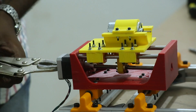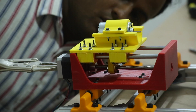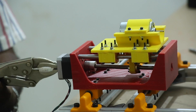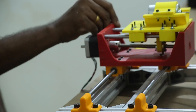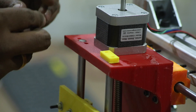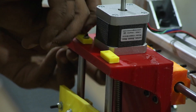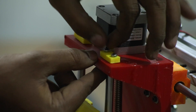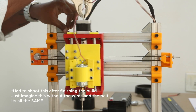After tightening the shaft coupler to the threaded rod, I can give it a test. Such a happy feeling when it comes together — I guess that's why I love making such things. Now I can seal the top side of the smooth rod with a small 3D printed piece, which will help avoid the smooth rods sliding out. There is no need to use a nylock nut here. And with that, the X-axis and the Z-axis are done.